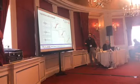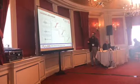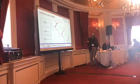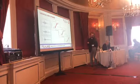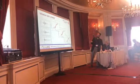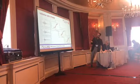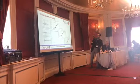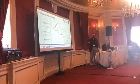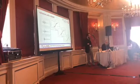So in the very first trial, a sample of earthquake records was implemented, and we could not, to a great extent, achieve the experimental results. But after refinement of the model, after 2 or 3 iterations, we could achieve up to 10% difference in terms of energy dissipation and initial stiffness, a better agreement between the experimental and numerical results.